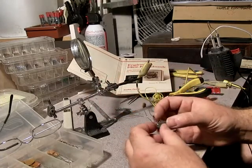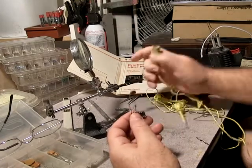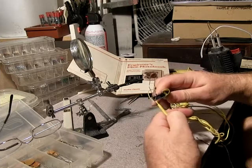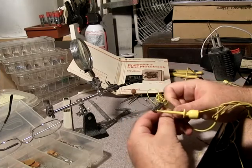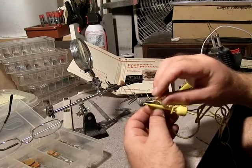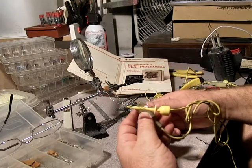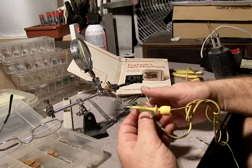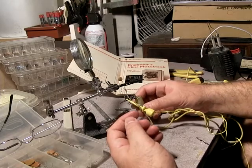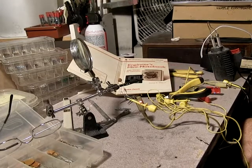I'm going to keep working with this because I really needed to get it to work. Mastering this chip is going to add a whole lot of possibilities to anybody's arsenal of tricks with their scale models. If you don't want to sit through all the other videos, this is basically what I was going for. Having a breadboard to do this with is a lot easier. Plugging your LED into any of these pins will give you a various blink rate. The resistor and the capacitor will change that blink rate. Various chips will give various blinks, and I think I'm pretty much through demoing this. This is a hassle, but it's a worthy hassle. Catch y'all later.